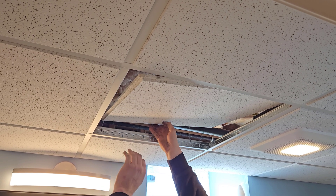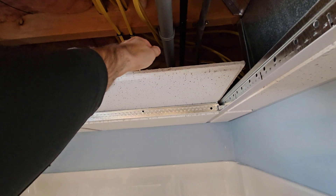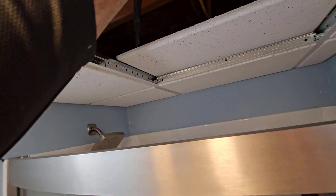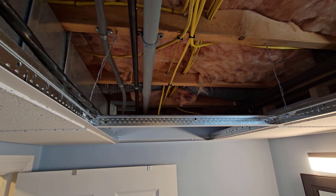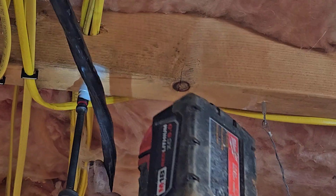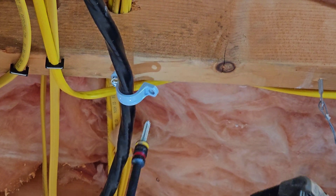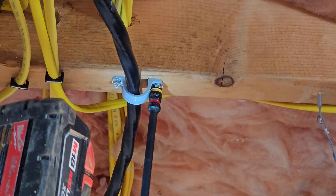This next part is where we forgot to narrate while we were working, but the basic idea is you need to plan a path for your wire. We were going through a finished part of the basement with a drop ceiling where we needed to move tiles out of the way, and then an unfinished part with lots of other pipes and wires. Plan the route, try not to make a headache for whoever might be working in the future, and make sure you leave enough wire on both ends to connect to the panel box and to the outlet. You don't want to install all the clips and then find you're just a few inches short. Use one of these clips every few joists — you don't need every single one since the wire is pretty stiff, but you don't want it flopping around.